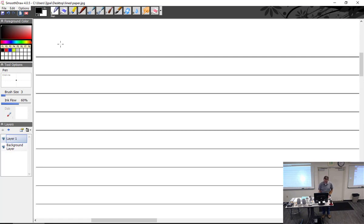All right. Prop aux systems. First thing we're talking about is the propeller prop synchronizer. So the prop synchronizer is going to match engine speed, or propeller speed if they're geared, but I guess it's still engine speed. No, turbine would be prop speed. So prop speed, engine speed as appropriate, so they're exactly the same.